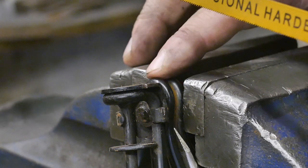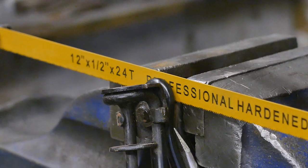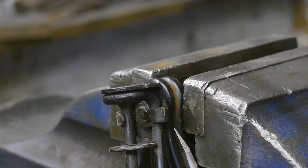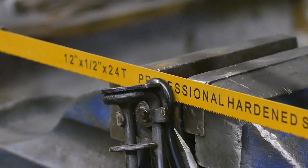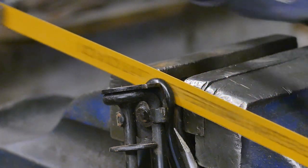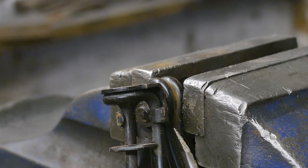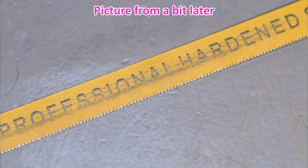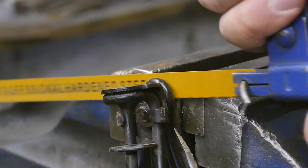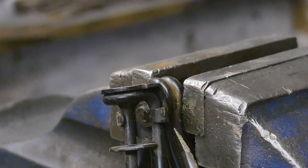New plan — I'm going to cut it between these two legs of the frame; there's plenty of room there and the bolt isn't thick there. I installed a new Chinese blade so all of the teeth are still there. But man, this blade is terrible — most of the teeth are already gone. I think that pin must be hardened. At the end of the blade there are still a few teeth left, but in the middle there isn't any cutting action. They are definitely case hardened.